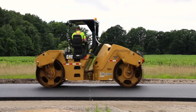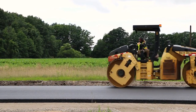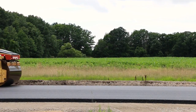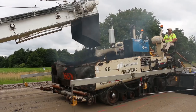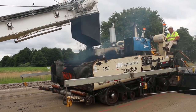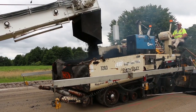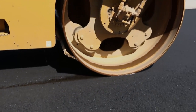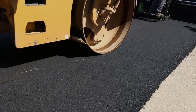The purpose of rolling is to leave the hot mix asphalt courses sufficiently dense and smooth, and to give the top course a pleasing appearance with no roller marks or unevenness. It takes a combination of rollers using the correct frequency and amplitude settings, used skillfully, to successfully compact the hot mix asphalt pavement courses.